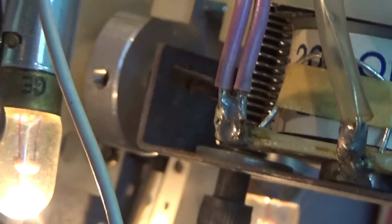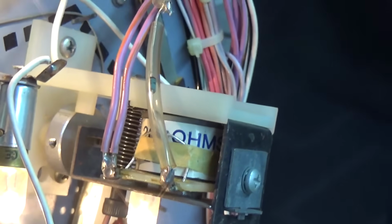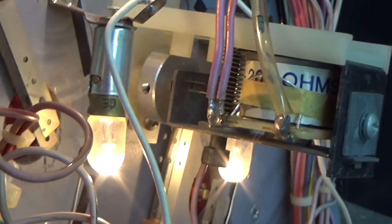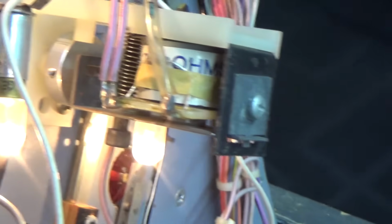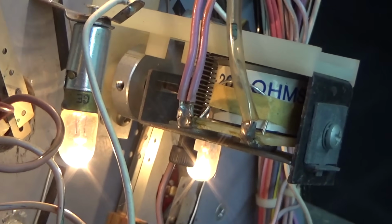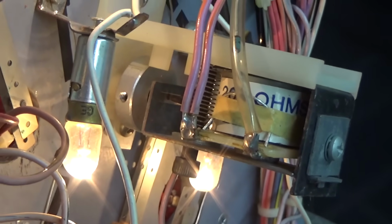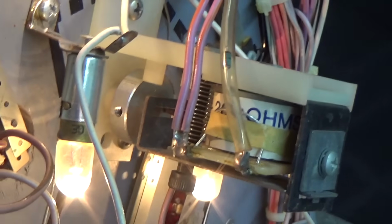So what's usually the problem with these is that they're just filthy. It may be the post going through the Playfield, but something will just be dirty. So I need to clean that and maybe even oil the shaft going through the Playfield. I think it's going through plastic, though. You don't really have to oil plastic, but it's either that, or there's something jamming there where it's just getting stuck. You saw how if I forced it, it just went. So that just needs cleaned up.